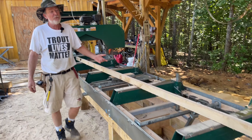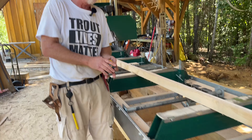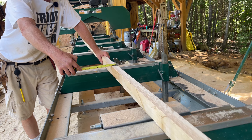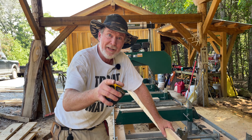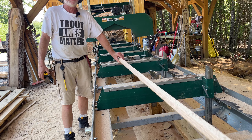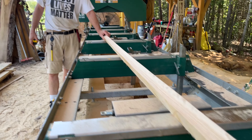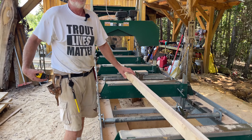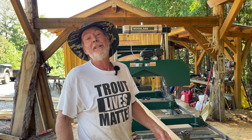Now look, I've got a piece of white oak that's an inch and three-eighths thick, because that's actually how we made our boards. We know when we clean them down, we're going to have a perfect five-quarter — not that one-inch stuff you get at the store. That's how thick my decking is going to be on 16-inch joists — it's going to be ridiculously strong. But this piece is not good for the decking.